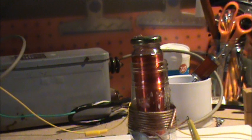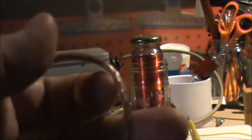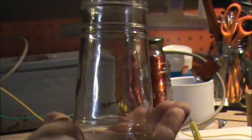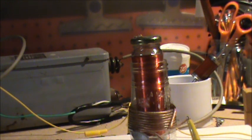Let's talk about the coils we're using. The coil form — the primary — is just a bit of speaker wire, your regular old 16-gauge speaker wire. It comes in pairs; I just split it down the middle so you get a single strand, then wrapped it around an olive jar — you know, the olive jars with that semi-conical shape you see at the grocery store. That works great, and one of them nests right into the other.